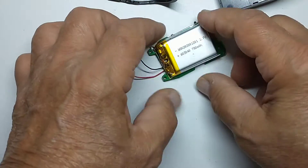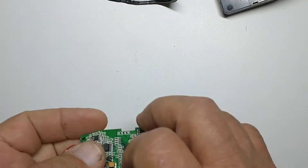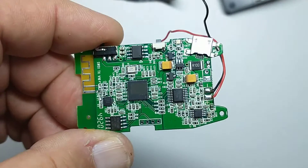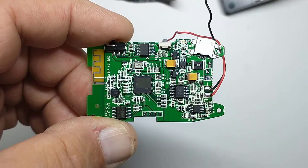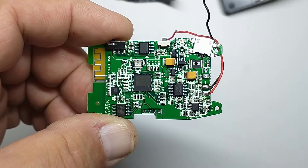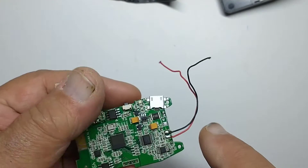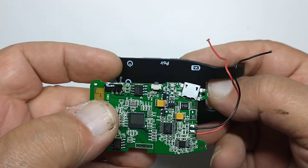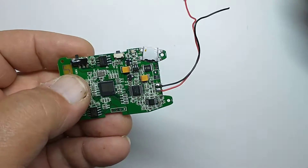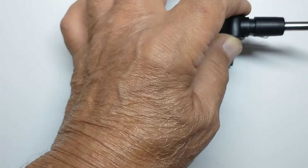You can see there's the lithium battery on the back — 700 milliamp hours, 3.7 volts. And on the front there's all of the circuitry. There's a mystery chip right in the center, which I guess is their chip, but there's no marking on it so it's hard to figure out what it is. Here's where the USB goes in so that you can charge it. Here's the switch that says pair, and here's the switch that turns the power on and off. And here are the two leads that go through this little area into the middle and go into the mono plug.